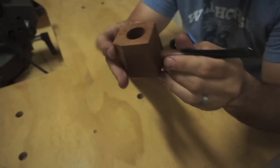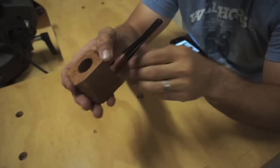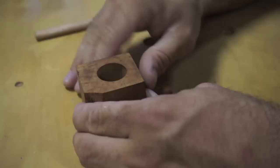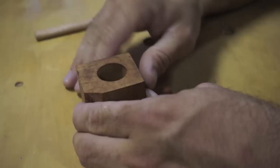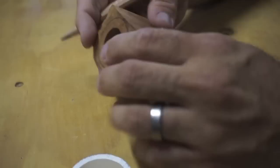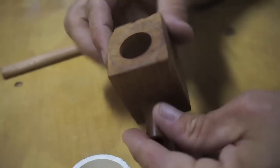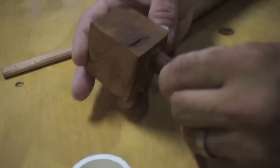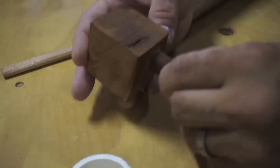Maybe when I get this done I'll give it a shot — give her one run and then maybe I'll be done, according to my wife. So the first step is to give myself some template marks. I want to make sure the wall around the bowl area is pretty consistent, so I found this piece of inch-and-a-half PVC — I'm just going to use that as a basic template to get this thing roughed out. I'll line this up, give my marks, measure the centers on either side, and start roughing it out into basically a cylinder with a slight curve under.